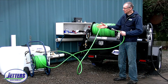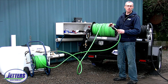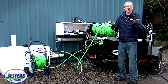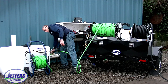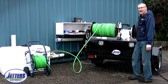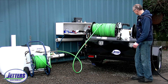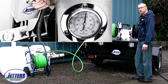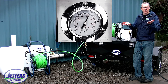To compensate for the extra resistance of the three-eighths hose, I've put larger orifices in the warthog nozzle. Specifically, I've taken out the 057 jets and put in 063s. Now with it back in the line, firing it up and letting it settle — it settles out at about 1500 PSI like it did the first time without the three-eighths hose. Bringing pressure up with the throttle — you can see them increasing at about the same time. There's full throttle and there's full pressure.